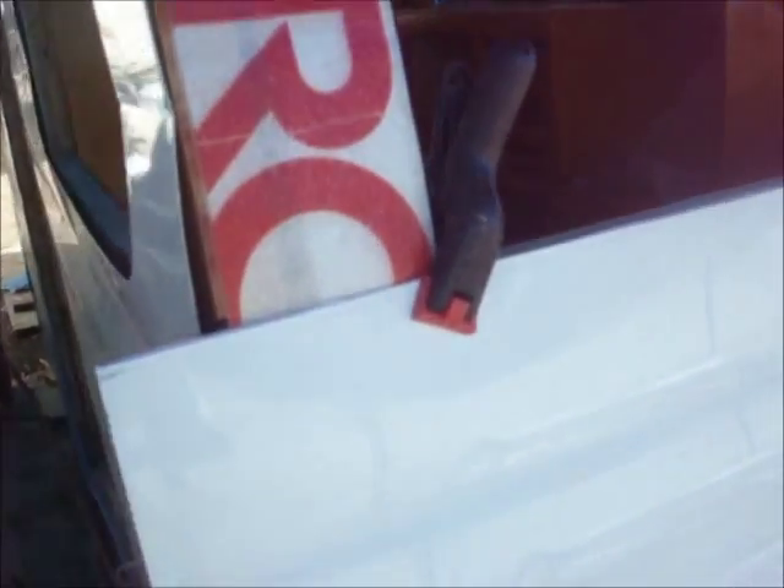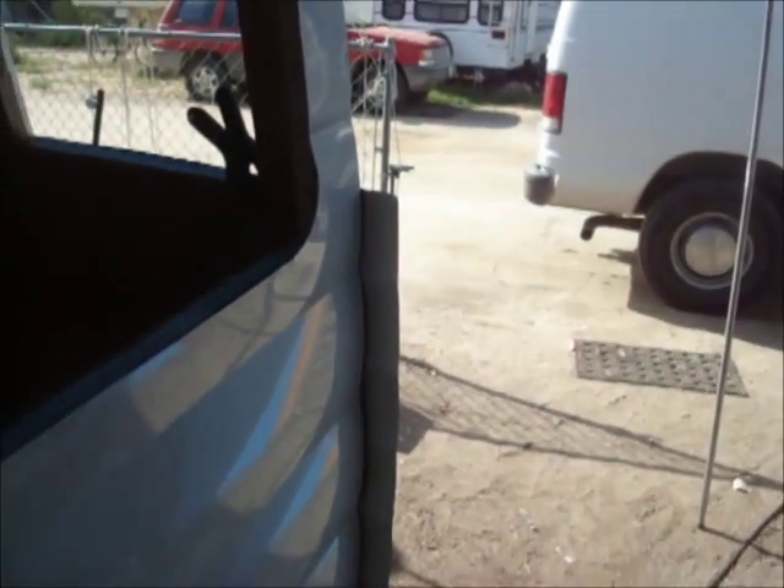So that's my excuse for not making video. What we're going to do today is finish off the metal — we have to put the little metal strips in here around the windows, which I already tested. I put them in and made sure everything fit okay first. You want to do that before you do anything else. What we're going to do is draw a line all along here about 5/8 of an inch out, cut it, then bend our metal over and staple it.